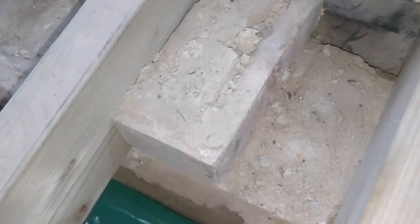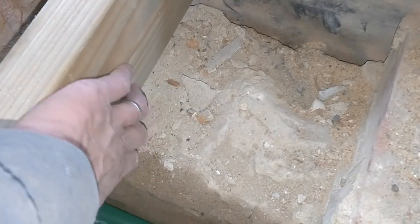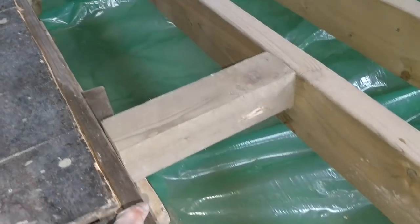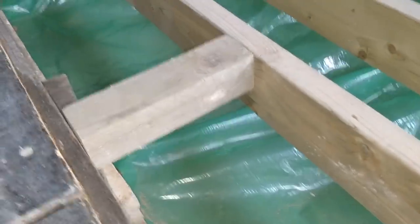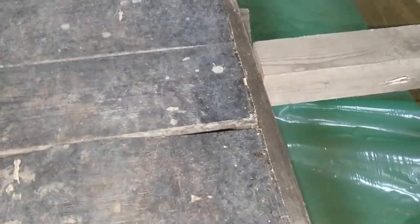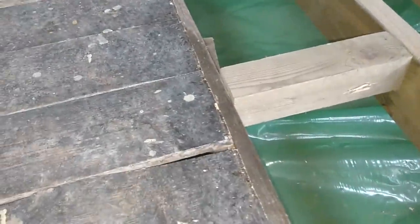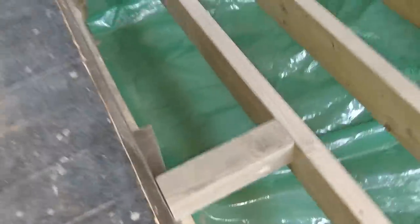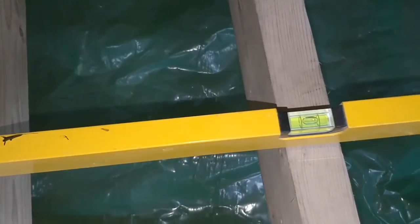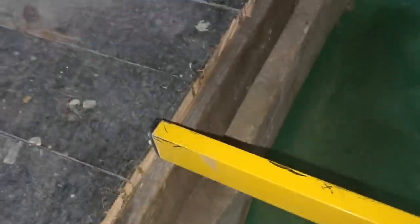With the joists I've spanned across, I've basically sat them on the brick — there's a slight gap in some instances but if it were ever to slip it's catching on structural wall down onto foundations. I've fixed them through with screws, sistered them up against the existing joists, put a noggin across, and put in the new four-by-two. I've done whatever I can to bridge new floor in old house meeting old floor in old house. Checking with the spirit level — matching old with new — that's pretty good. I'm quite happy with that. That's basically all the main flooring done.